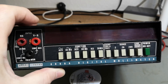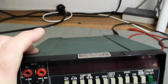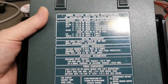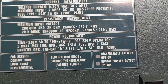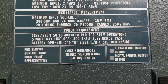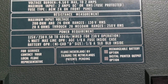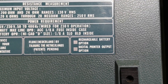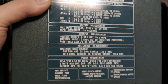It is only a 3.5 digit LED readout. It comes with different options and they're normally written on the back, and this is actually very important to inspect — what kind of options you got. Especially see here in the middle of the picture, it can do 115 or 230 volts, but this one is wired for 230, so that means I can power this up. Also, the rechargeable battery option is not a thing in this one, and that is good.